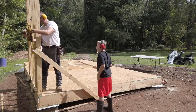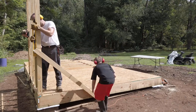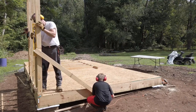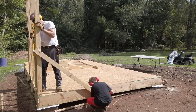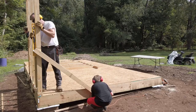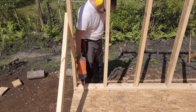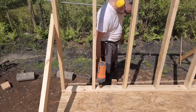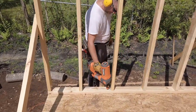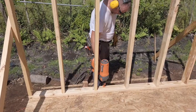I'm going to plumb this wall using a level and my son is going to drive a screw into the end joist for bracing when I've got it where I want it. The nail pattern for a bottom wall plate is you're supposed to go into a floor joist, a rim joist, or blocking every 16 inches. Check your local codes — they could be different.